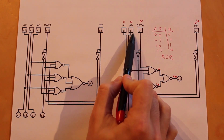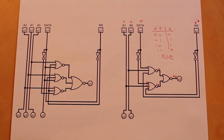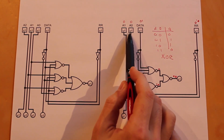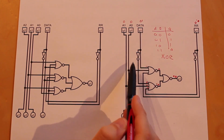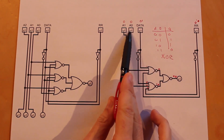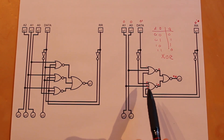We were able to build an exclusive OR gate with just three NOR gates and a couple of inverters, but that's just at address zero — there are actually three more addresses to go through. Rather than figuring them out one by one on paper, I think it would actually be easier to just build this on a breadboard and see what the result is by experimentation. So let's go ahead and pull the breadboard out and get started on that.